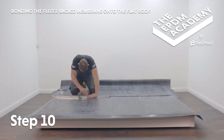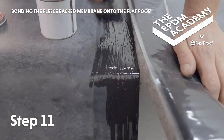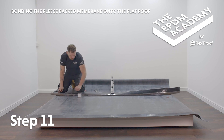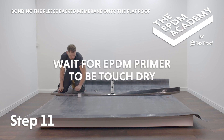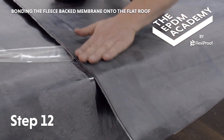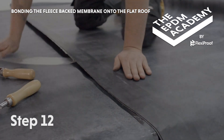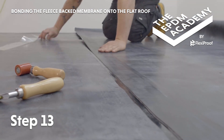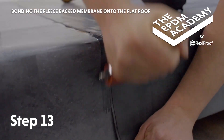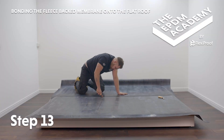Use a spirit level straight edge to mark the surface of the bottom sheet to create a prime line. Use a paint brush to apply EPDM primer along the edge of the bottom sheet within and 10mm past the prime line. Wait for EPDM primer to be touch dry. Lift the edge of the top sheet up and peel the seam tape backing strip off at a 45 degree angle, following with your other hand and smoothing the membrane into place. Press the overhanging section of the top sheet down onto the primed area of the bottom sheet. Use a silicon roller to apply pressure and activate the seam tape throughout the length of the join, making sure to apply pressure to the edge.